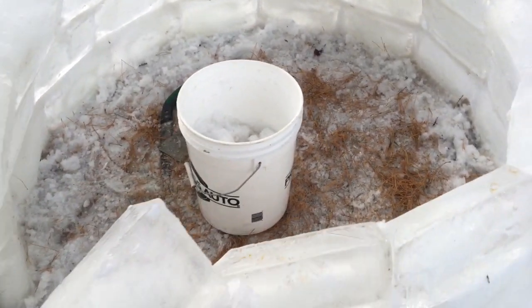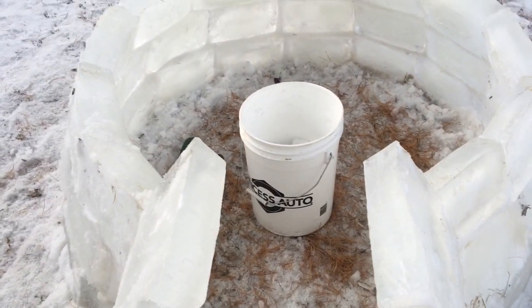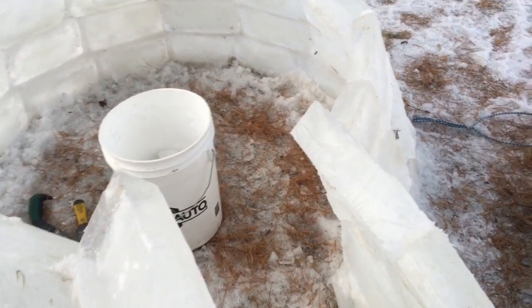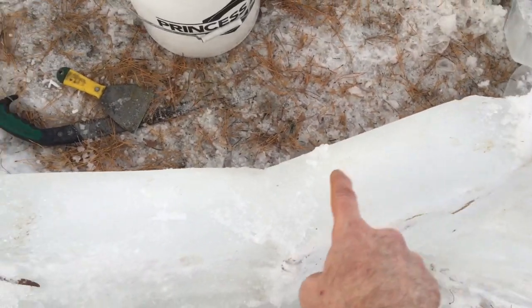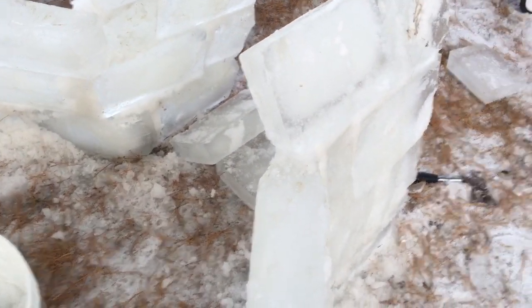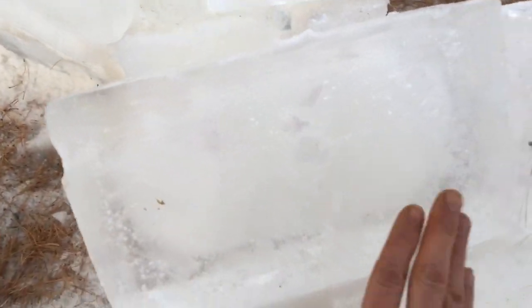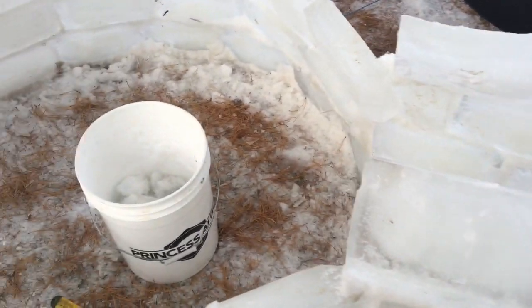Your fingers and mitts will soak right through to the bone, so make sure you don't hold on to the bricks too long, especially if you're balancing them, or you won't be able to let go. What I do is put quite a bit of slush along here and some up on top if you can, then set the brick in place and hold it with my elbow while I pack the outside and inside with my trowel. It doesn't take very long and they freeze into place if you've got the right slush.